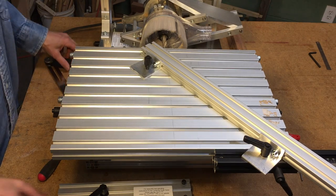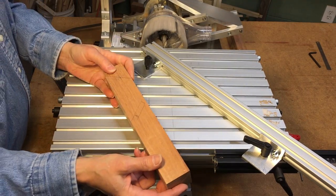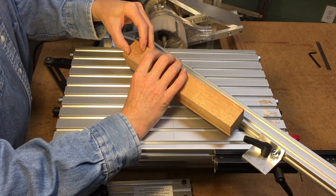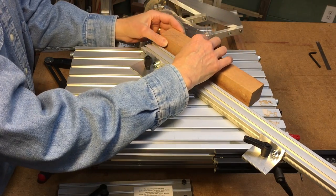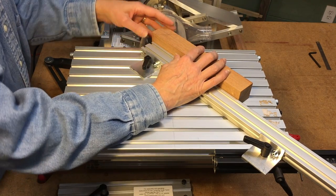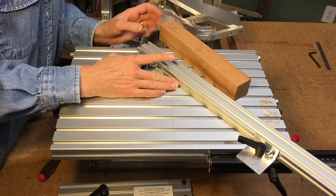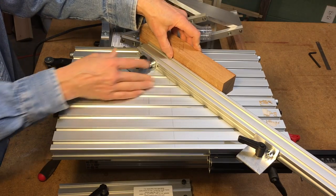On my corner bracket, I'm going to be using a one inch tenon — a pair of double one inch tenons horizontally to slide into the chair seat rails. I want them off the table a little bit, so I won't be lining it up dead center, but I can line it up off the edge.